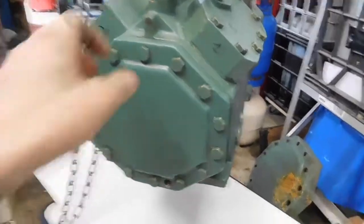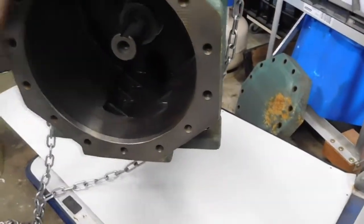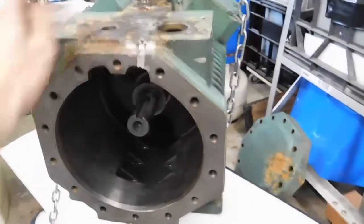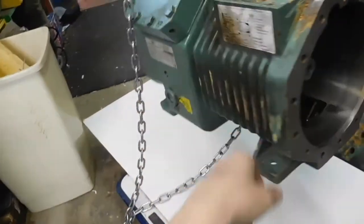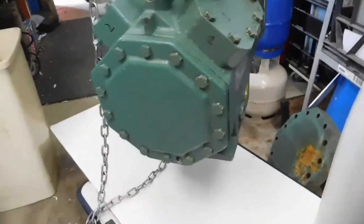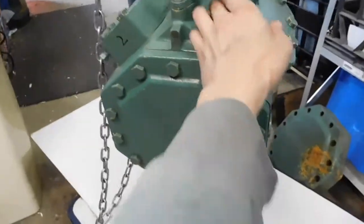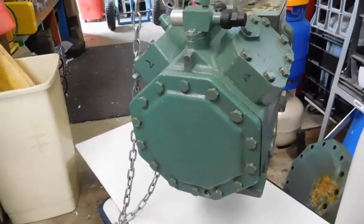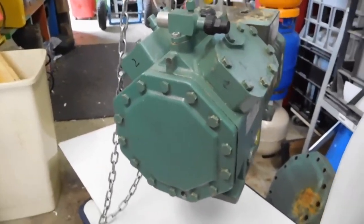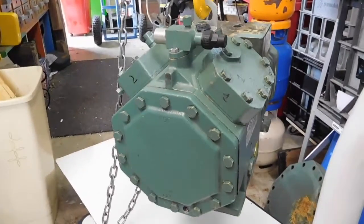Okay, I've got it all back together, all ready for painting. I'm going to take it outside and give it a spray over — I'll cover this end up. It turns over really nicely now that I've got that end on. I'm going to hit it with some methylated spirits just to get rid of all the oil, then give it an undercoat with some zinc gel and then go over it with a nice silver finish. So it should come up quite nicely.